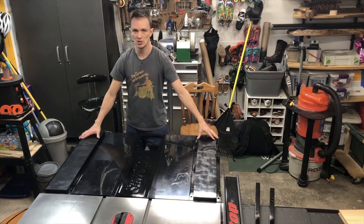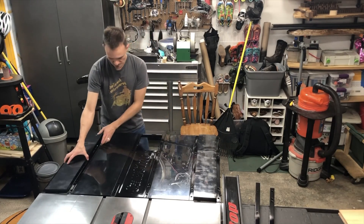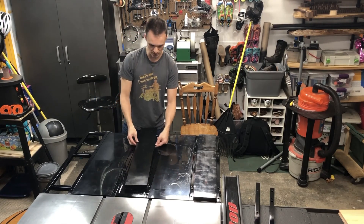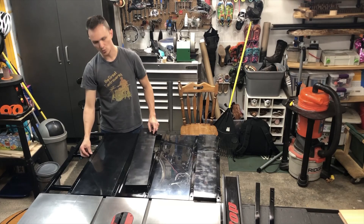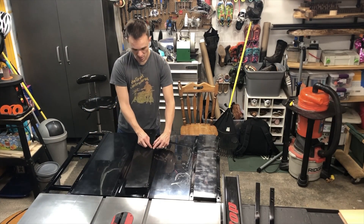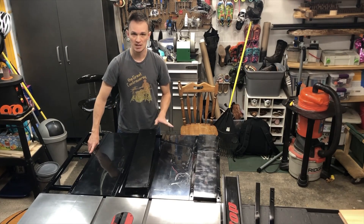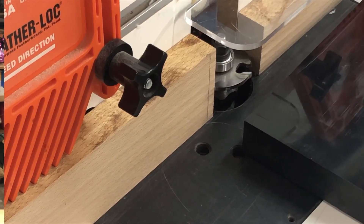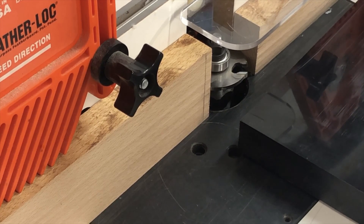To incorporate the rollers, when you slide these side ones on they're going to be a little more difficult because when the legs swing up you're going to have to cut a groove on the bottom side for the legs to have room to swing up into. You can cut it all the way through or router a recess on the bottom so it still looks flat. That recessed area on the bottom is going to be pretty thin, so you may find it easier to just router that spot out or cut a notch with a bandsaw where that leg swings up. We'll do both sides, use the test piece as a template to know how high and low to set the router bit, and then do a test fit to make sure it fits snug.